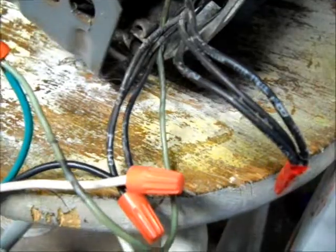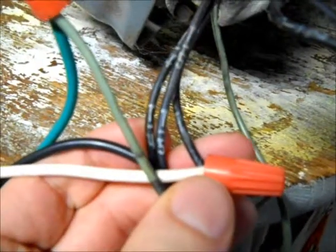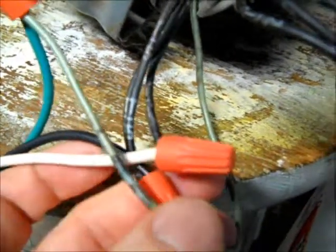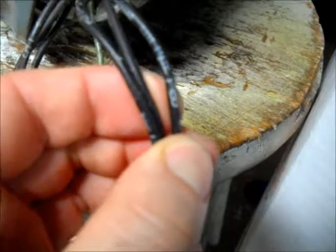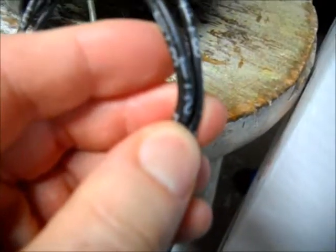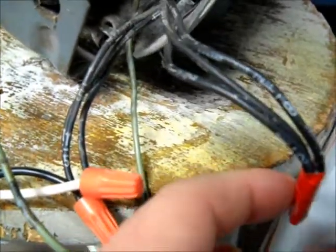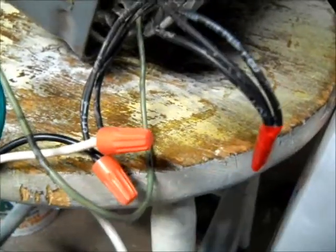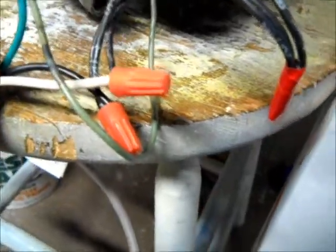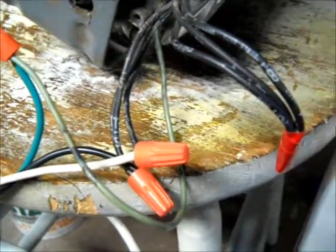Okay, so here's what I was talking about with the wires. You can see T5, and then there's T4, and then these wires here I got taped together — T8, T2, and back there T3. Just like I said in the wiring diagram, right now this is wired for 220 volts, but I'm running it off of 110. It would basically look the same way if you were running it off of 220 volts.